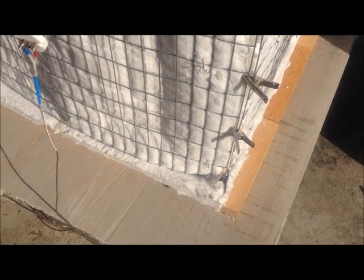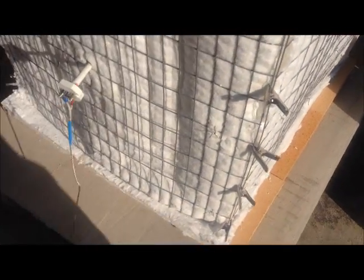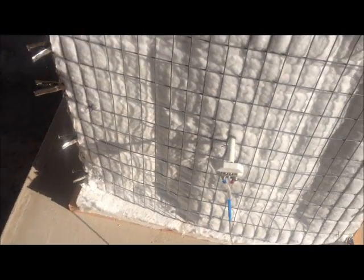The kiln is collapsible and it's held together by a number of just little 98-cent alligator clips. I've got five of them on each edge, and the square shape formed by all these being held together is just resting on top of another piece of two-inch ceramic fiber sitting on top of these fire bricks that I had to order online.